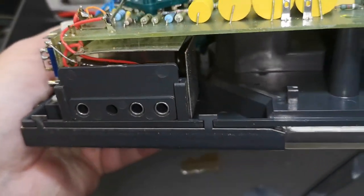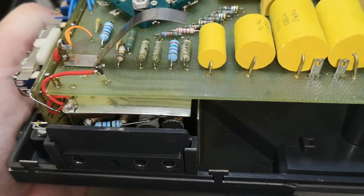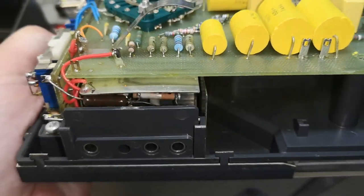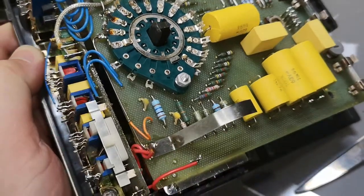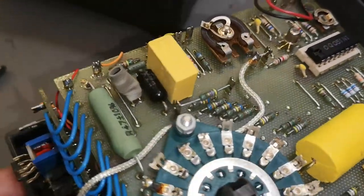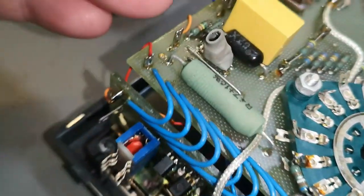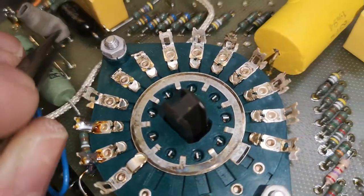Oh yeah. And if I look carefully in this little gap here, I can see some resistors and some capacitors. Of course, they want those capacitors to be in parallel with the resistors, so they will kind of speed this up, so they will give you higher bandwidth, especially for AC volts. We also have a trimmer capacitor here again to make it good in AC volts. That one, I don't know what that is, but aren't we going to have a little look? I see a little piece of metal. Can we just, I really would like to have a look in here.